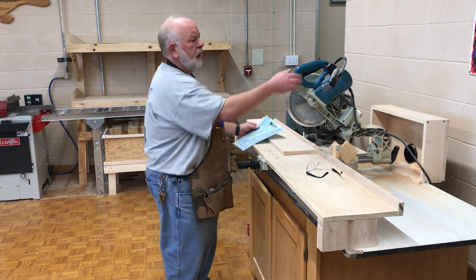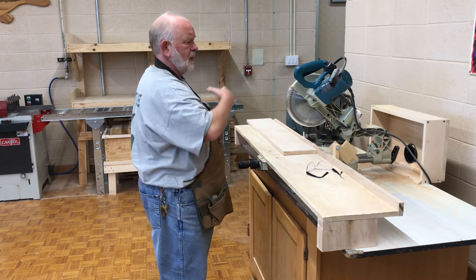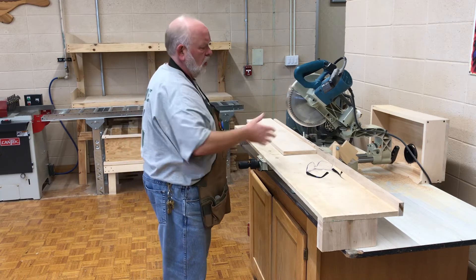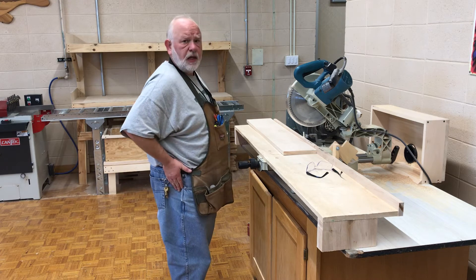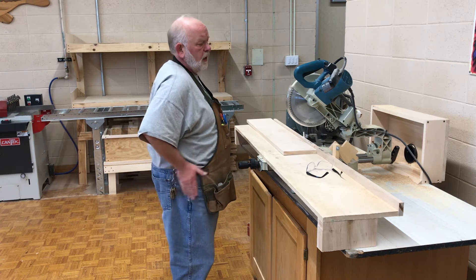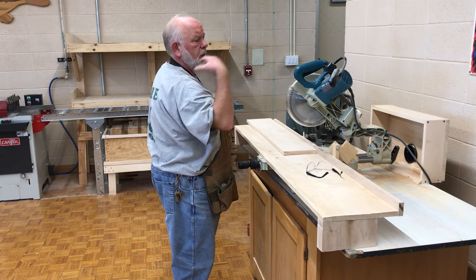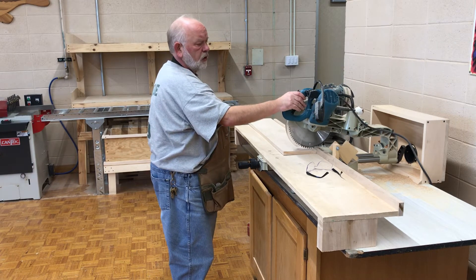Never stand in line with the saw. Some of you like to cut with the saw hitting your mid-chest — you don't have any power or control that way. What you need to do is have your right hip in line with the saw, just like the table saw. A lot of these applications and safety rules apply to multiple machines. Your right hip needs to be in line with the saw so you can use the power of your shoulders and arm to actually cut.